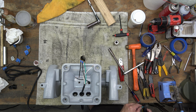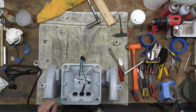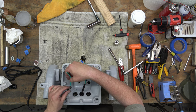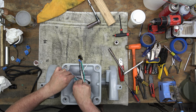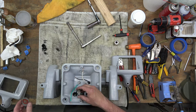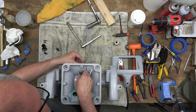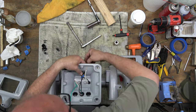We're going to cut a short piece of ground wire and put a larger ring terminal on it and shrink that down with heat shrink. Then we can attach it to one of the mounting bolts for the base to the stator — that's how we're going to ground everything. Next, we'll install the switch. We've got that switch panel that goes on the outside of the base. I'm making sure I got it oriented correctly, then insert the switch through it. It's got a little nut that goes on the outside that holds it all in place.